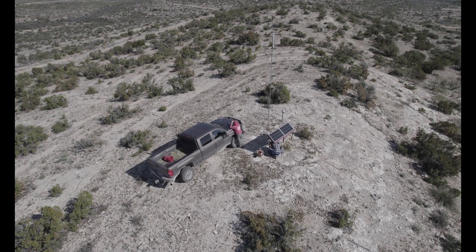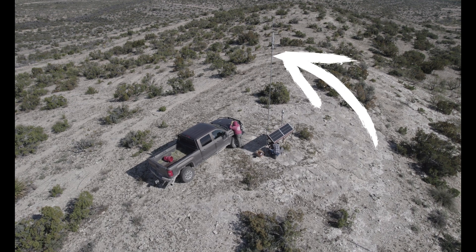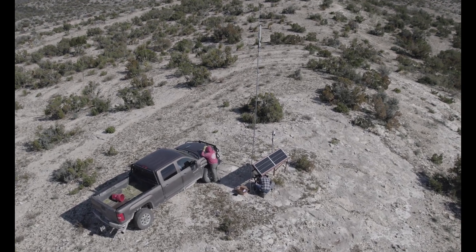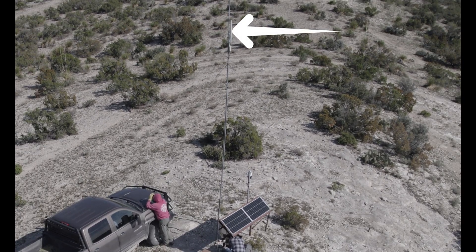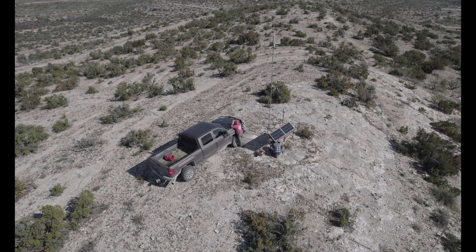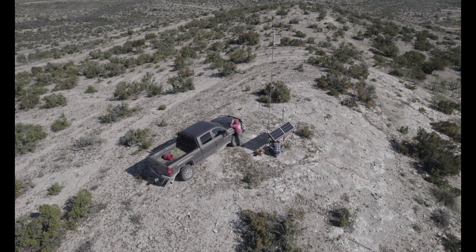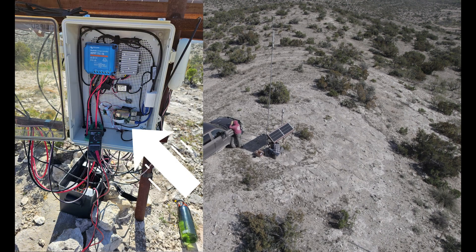The main thing you can obviously see is those solar panels, and then we have that tower there. We have multiple different communication systems in place. One is a wireless protocol I basically invented based off of a LoRa standard — a 900 megahertz system. That communicates with many different sensors spread throughout this ranch, allowing us to check for temperature, humidity, gate information, and a lot of different sensory data. The antenna on top of this tower picks up that data and pipes everything through a Raspberry Pi.